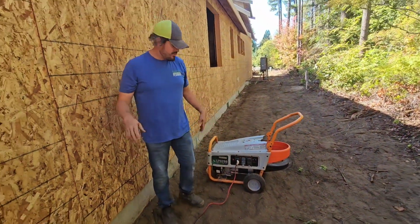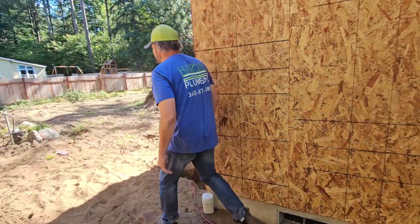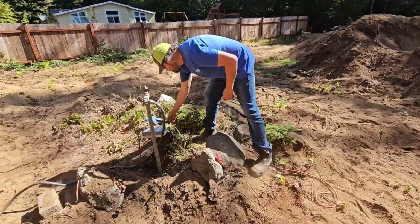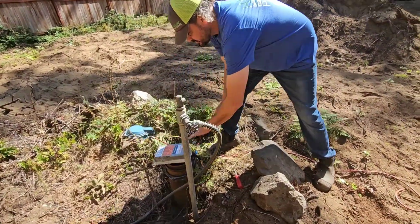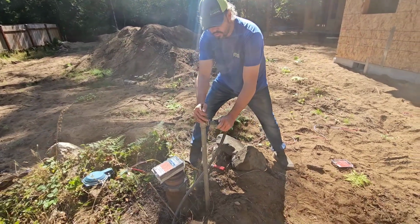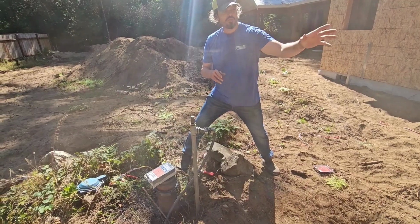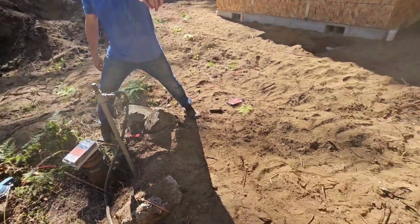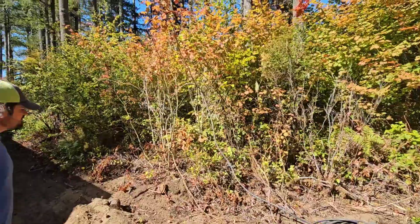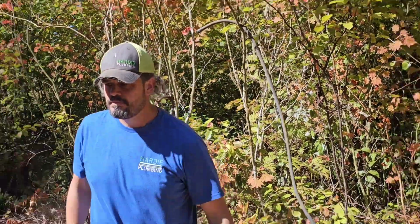So before we do that, let's do some double checks. So we're plugged in there. Our wire nut is there, that goes to the control box. There's nothing more that we need to do there. Here's the standpipe. We got the hose bib on. So when that turns on, it's immediately going to have some flow and something to do. So we got a hose on it. It goes over here. So when we fire that off, we should see water coming out of here. Okay, let's do it.